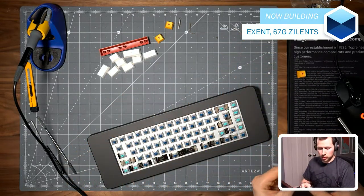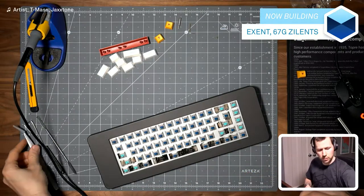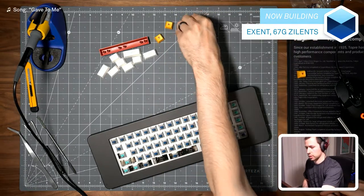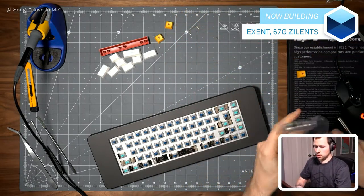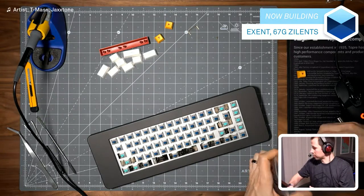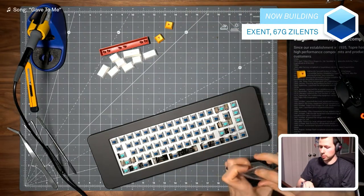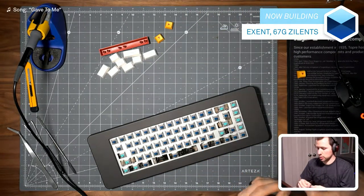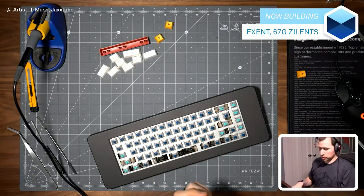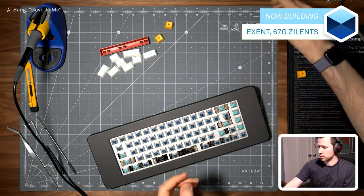Generally speaking, whenever I have a problem like that where a key doesn't work, the very first thing I do is open that keyboard tester app and tap every key, because it'll show you the codes being fired by the keyboard. In this case, I could see Alt was being fired and a bunch of other keys. So I knew it had something to do with Alt, and then I just start desoldering, basically. Desolder the switch, I think it is. The next one, the next one, the next one. Gotta save this screw so I can fix that stabilizer.